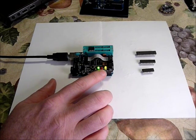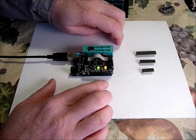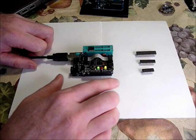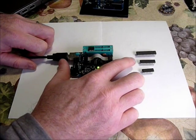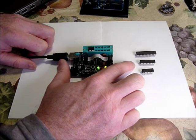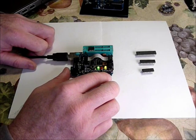This works for not only the Arduino's standard 28-pin ATmega328 and the ATtiny85, but it also works for the ATtiny84, which has 14 pins, and the ATtiny2313, which has 20 pins. So there's a wide variety of chips you can use depending on what your project needs.